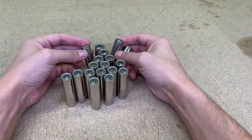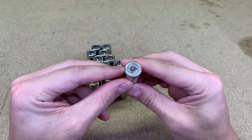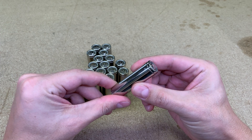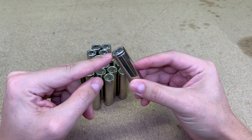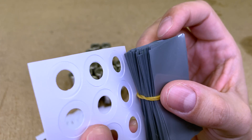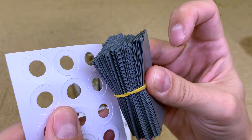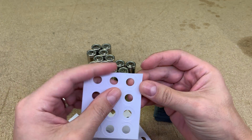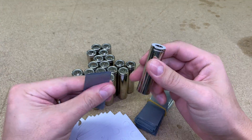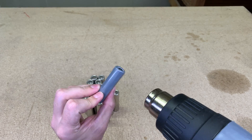After cells were disassembled from the original Tesla battery pack, they don't have any external insulation like the usual 18650 cells. So the first thing is to protect them to ensure safe cell usage in the future. For a few euros I bought insulator gasket rings and 18650 lithium battery heat shrinkable sleeves. Just glue the insulator ring on top, insert into the shrinkable sleeve, and heat it up with a heat gun.